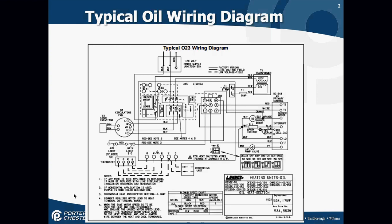A pictorial diagram is going to show you how to wire something, but a ladder diagram is going to show you the sequence of operation. A pictorial shows you what to connect where — down here, it shows the thermostat pins on the board and the dotted lines going to the thermostat. If you have air conditioning, it shows the dotted lines from Y and C to the outdoor unit, the condenser. It shows where dip switches are for fan delays. It shows how to wire everything, but it doesn't show you how everything sequences. That's why we use ladder schematics — they're great for sequencing.